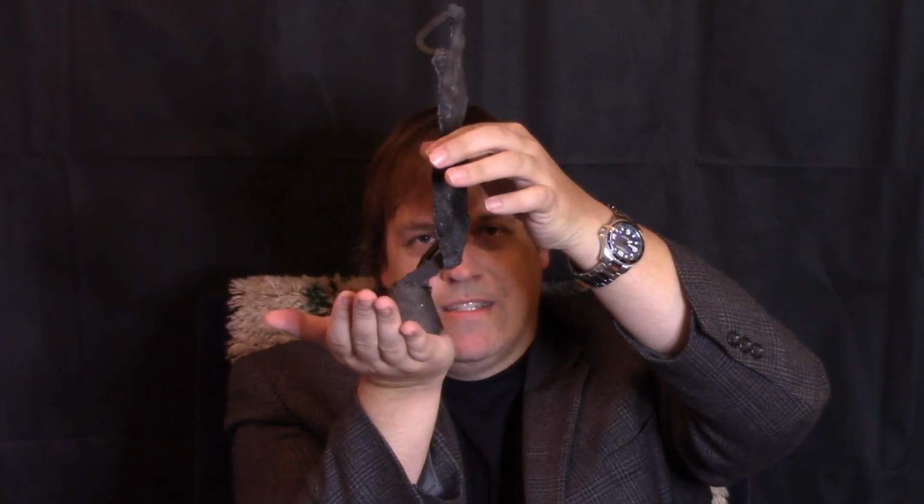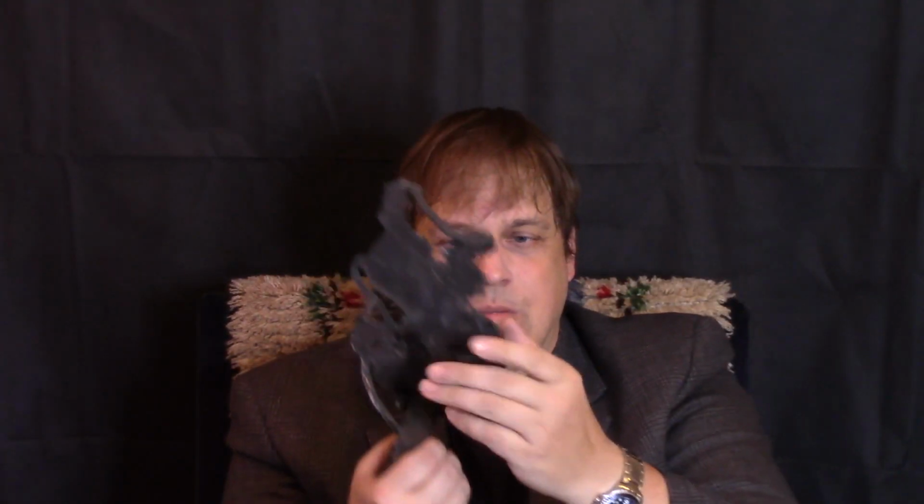Only the inside of the cup at the top is not coated, and the cup's flat top serves as the base upon which the piece stands during this process. Briefly, a piece should be able to stand on the cup like this during the process. A burnout is where the ceramic shell-coated piece is placed cup down into a kiln. The heat hardens the silica coatings in a shell, and the wax melts and runs out. The original artwork and the feeder and the vent tubes are now negative space formerly occupied by the wax.